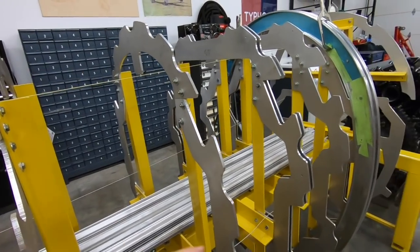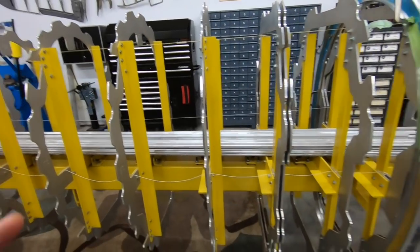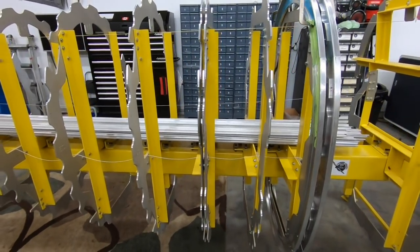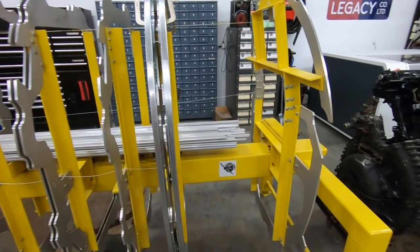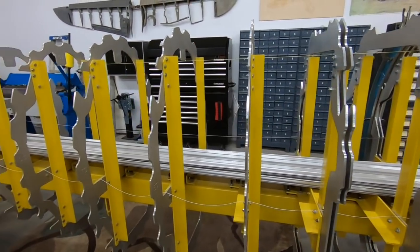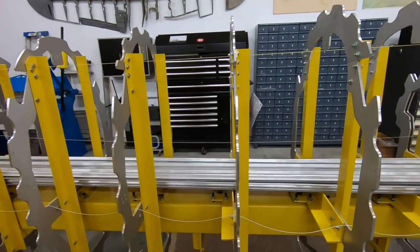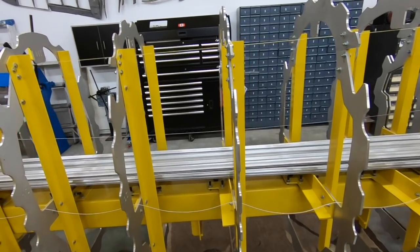So we have the proper frame shape, which is excellent, but then we have to look at all those adjustments on each of the station plate supports and start dialing those in. So with the Typhoon, every frame is perpendicular to the flight line of the aircraft, which is probably pretty standard in a lot of aircraft, but it's important to know that when we're dialing this in.